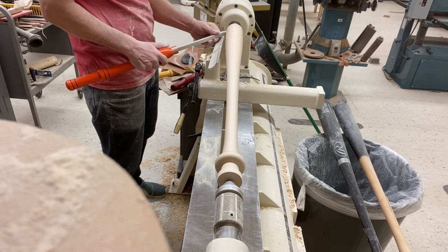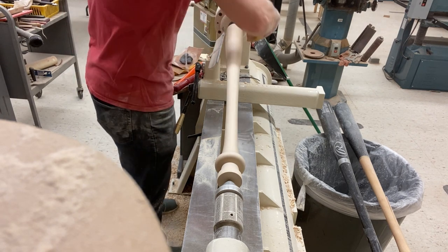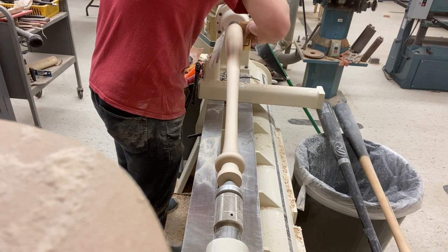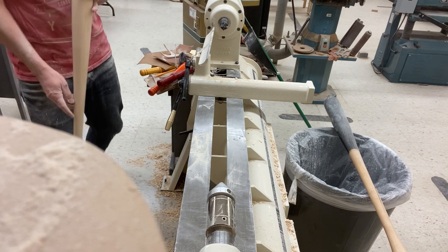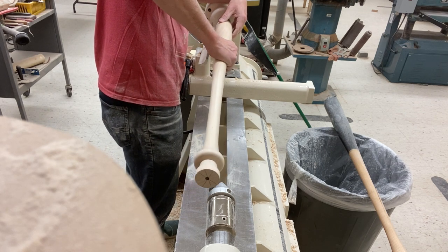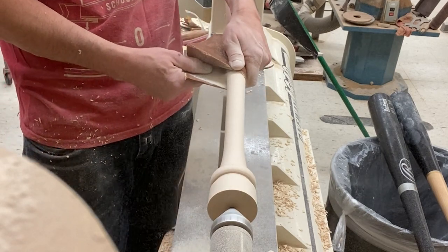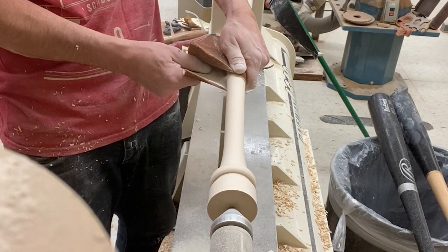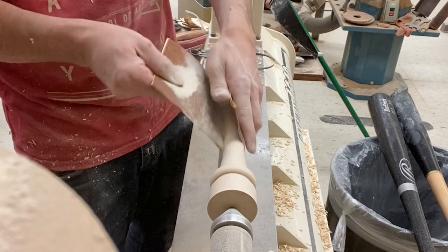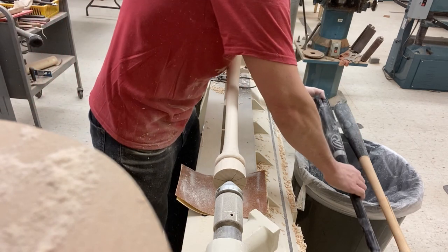Really you go through with the lathe using various cutting tools, some more detailed than others. Soon enough I'm going to jump in with a sander — I'll put sandpaper on the end of a drill. In this environment I really need to make sure I'm cutting the bat down into the right shape, because soon enough I'm going to take the bat off, put it on a scale, and if I haven't cut it down enough the bat's going to be too heavy. The test is: will the ball jump off the bat and not break, and will the bat be the right length-to-weight ratio. The more you make bats, the more you trust your eyes.